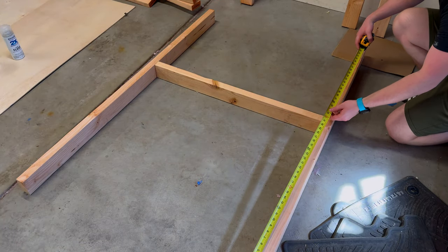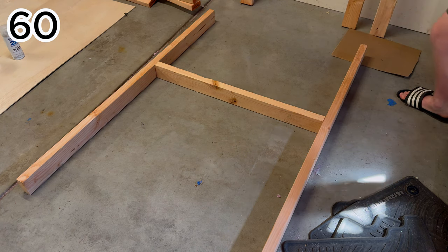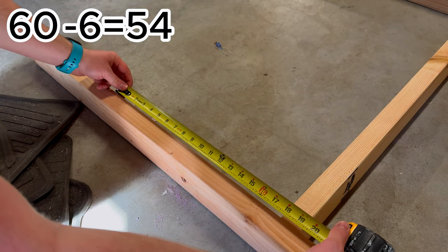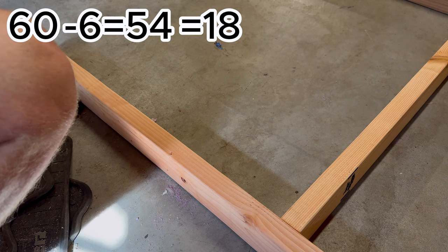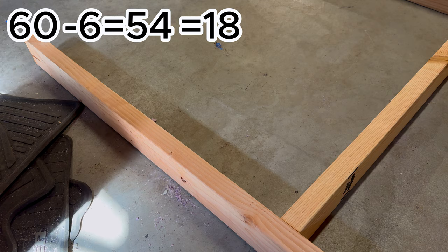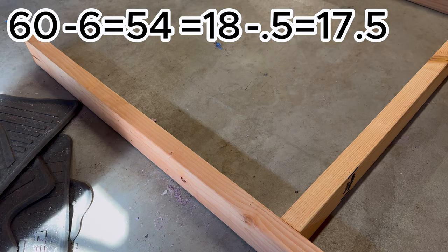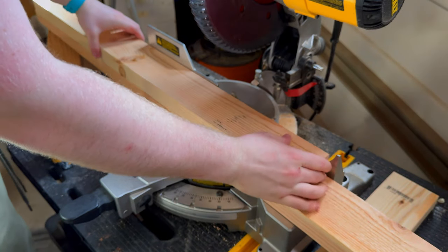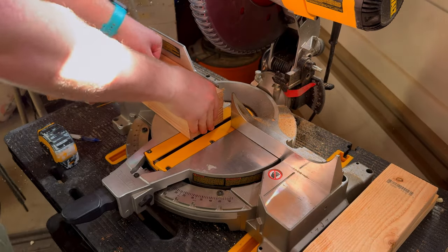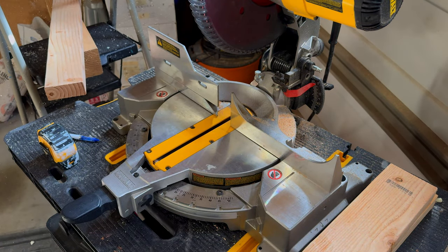The next thing to do is account for how many shelves you want. Take the full measurement of the stand, then account for the thickness of the two-by-fours. In this case I'm going to have four of them, so I need to subtract a total of six inches. Then divide that number by three and that'll give you the total length between each shelf. However, because I left a little area at the bottom for an extra two-by-four, I need to subtract a total of one and a half inches from everything, giving me a measurement of 17.5 inches. It's a bit of a complicated process with a lot of math involved, but it's necessary. Since we're going to be having two frames, you'll want to cut double the pieces — in my case I ended up having four shelves, so I cut eight pieces total.